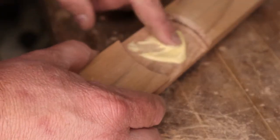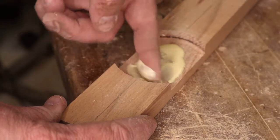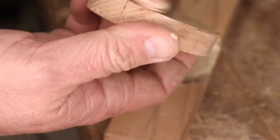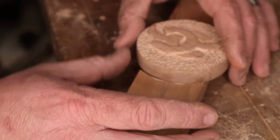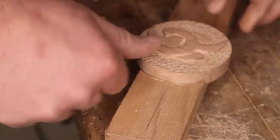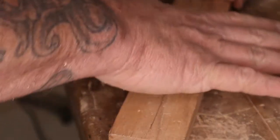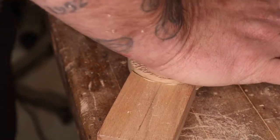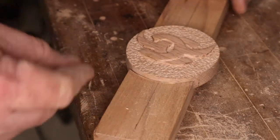You can always remove more but you can't put it back. To fasten the medallion I used some regular Titebond 2 wood glue on both surfaces and snapped it right in, making sure it had a nice tight fit and that the logo design was perpendicular to the handle. If I had that thing turned even a few degrees you'd notice it right off the bat, so you have to make sure your design is perfectly square and perpendicular to the piece it's mounted to.